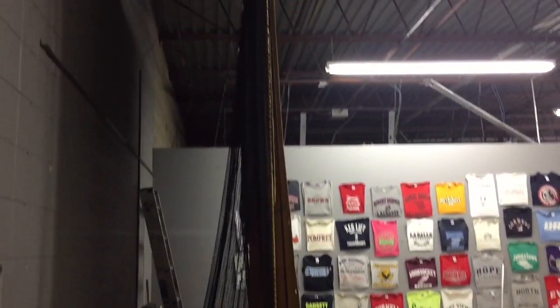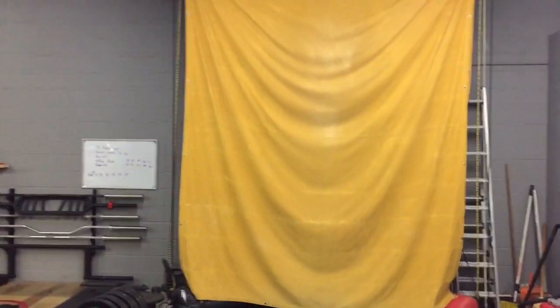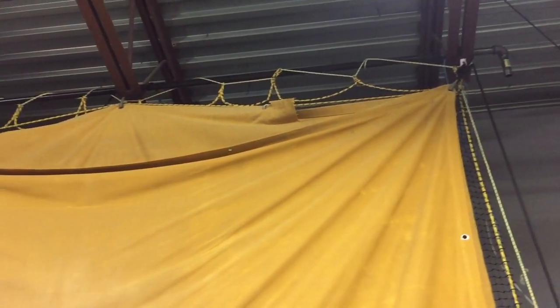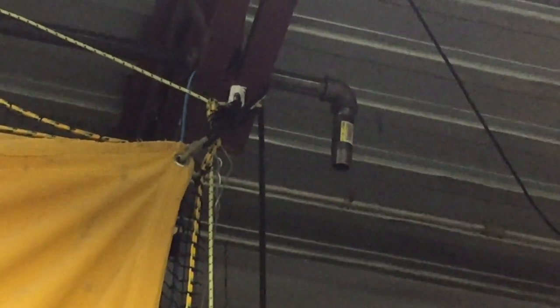The number one question we get is how we actually hung this. We've got two fluorescent lights going right in between, so I'll back up and show you. Our ceiling has these metal joists or beams going across it. What I did was — right there — there is a black pipe I got from Home Depot; I believe it's two-inch threaded black pipe, 10 feet long. On each side I put a 45 or 90-degree piece and a little 6 to 12-inch piece on the end.